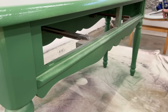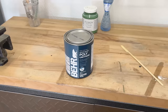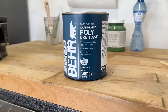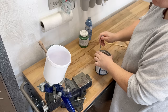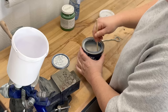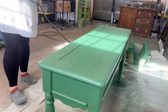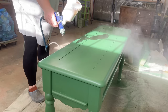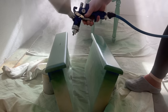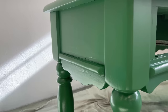I sprayed on another two coats, again waiting about two hours between coats with the fan on. Fusion is an acrylic resin paint that has a built-in non-porous topcoat — it's even waterproof and UV resistant once fully cured — so technically it doesn't need anything additional on top. But because this is a tabletop that will see a lot of traffic, I'm adding extra protection with a water-based polyurethane, which will also add a bit more sheen since Fusion on its own is just above a matte finish. Once my last coat of color was dry I washed out my spray gun, thoroughly mixed my can of poly to incorporate all the components, strained it into the gun, and sprayed on two coats. It's a lot thinner than the paint so I adjusted the flow settings back, but it does mist a lot and the topcoat definitely fills up the garage air and looks quite terrifying reflecting in the sunlight.